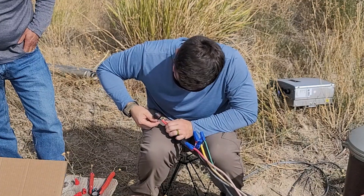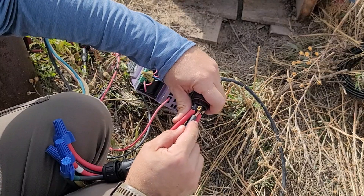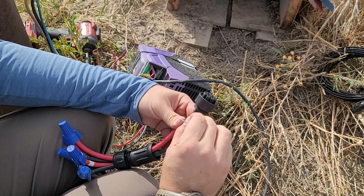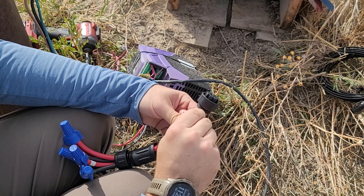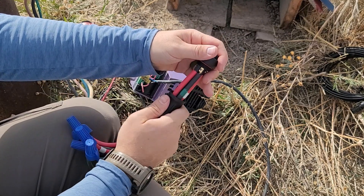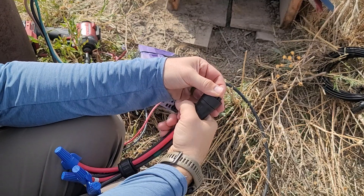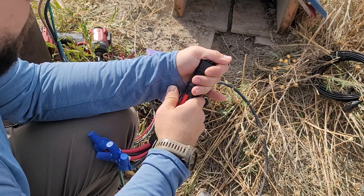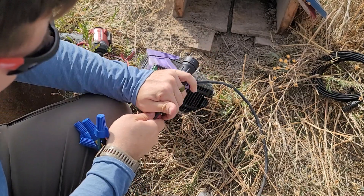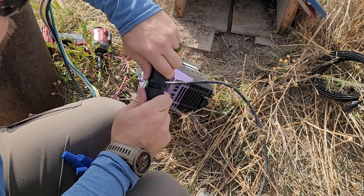These six-gauge wires going to my well casing are extremely thick, so I had to make these little pigtails in order to get onto this connector, and it was not easy. It took some finessing, but I was able to get it all put together. The biggest thing was that this wiring had a really thick sheath, and that made it really hard to work with these connector pieces. This is PV wire I'm using because it was scrap wire I had around, but I would recommend THHN — thin wire — instead of PV wire, just because it has a thinner sheath.